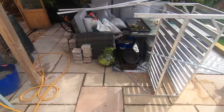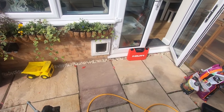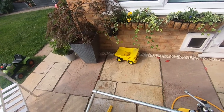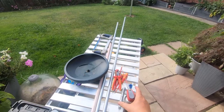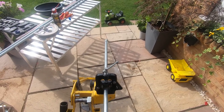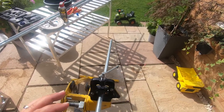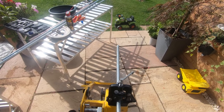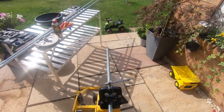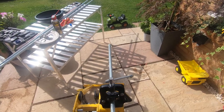So we've got our cutter, our fluid, our cutting oil, and put a bit of that on. That's gone on okay. And put a little bit into the tool itself, and then we just push on so it's flat on, and then we turn until it bites, and then once it's bit, you turn it back, and then we keep going. That's not holding very well, so we'll tighten that up. And now it's turns with the turn back. Same process again.